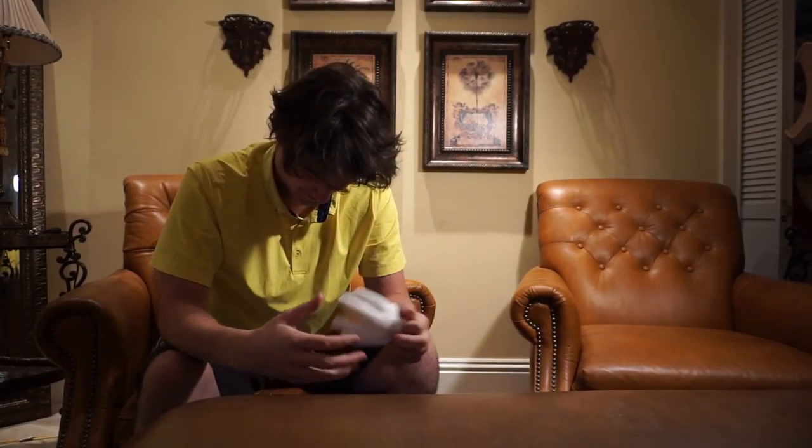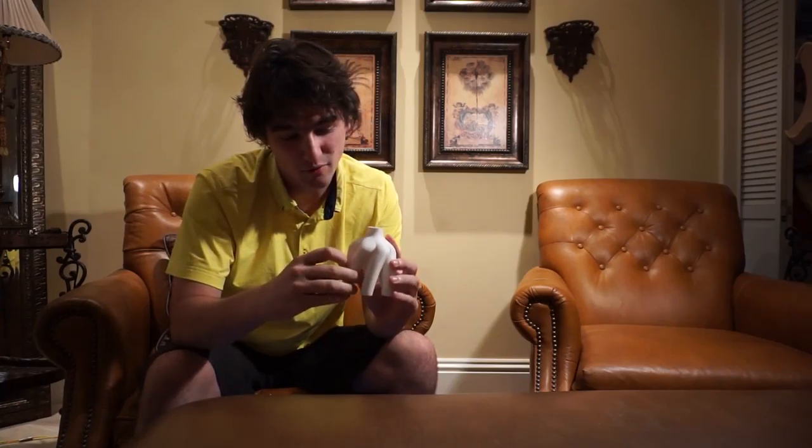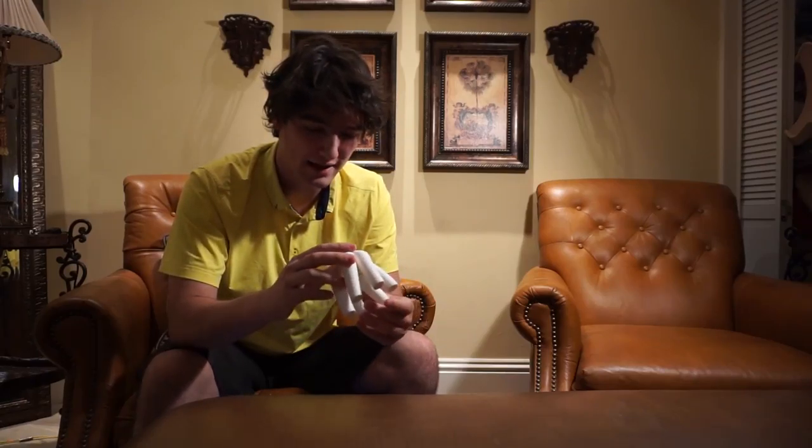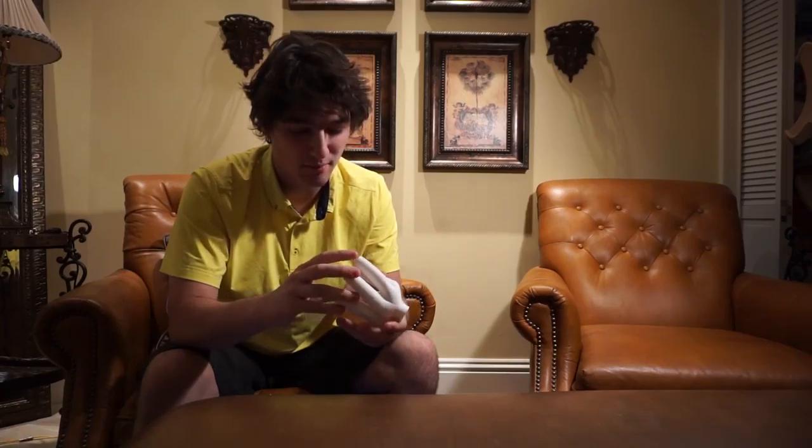Aside from these impracticalities, it's a very usable and cool-looking product with a swirl pattern. For the water tightness issue, I thought of a few possible fixes. One is changing the settings on the printer to make the plastic bond together better — either changing the extrusion temperature so it melts together better, or changing the extrusion rate to allow more plastic to come out, which might make the edges less precise but seal better. That or a change in material, though ABS is generally one of the more flexible thermoplastics — it can bend without cracking and melts at a higher temperature. Those are all things to consider in future revisions.